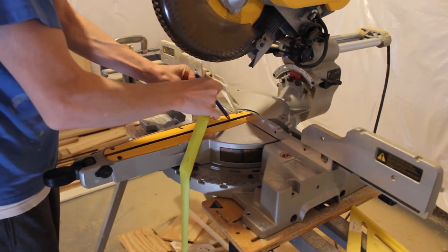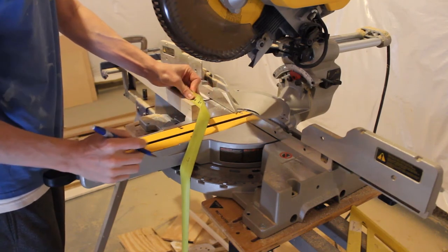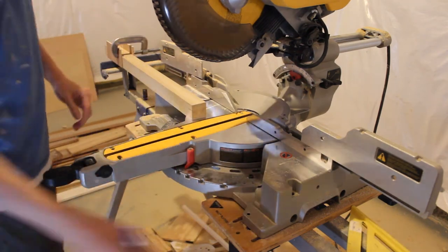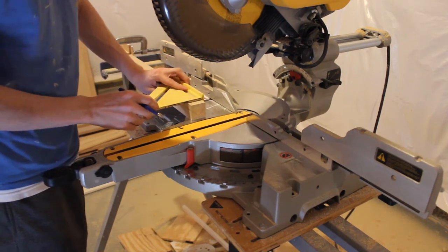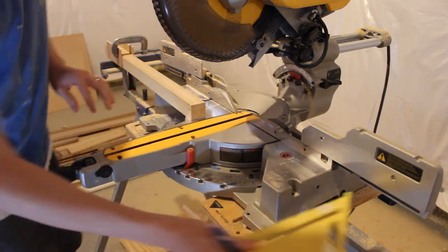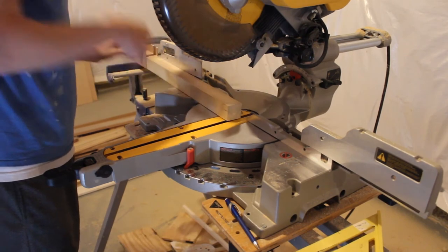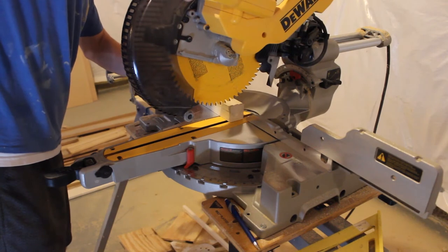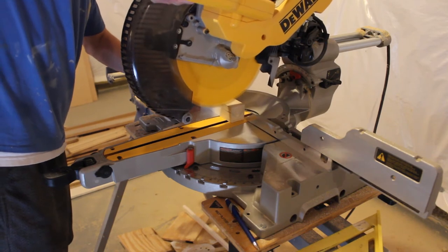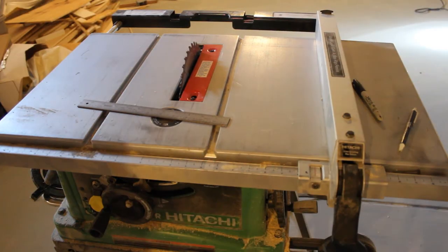I'm going to provide plans for all this at the very end. I'm just using a regular miter saw here. One thing you'll notice when I bring the blade down is how many teeth are on this saw blade — it's a 60-tooth blade and you're going to get a cleaner cut for building furniture. A 60, 80, or 90 tooth blade is what you want to use. You don't want to use a 20 or 40 tooth blade. The more teeth, the cleaner cut you'll get — less tear out, less whiskers. Invest in a good high-tooth blade.